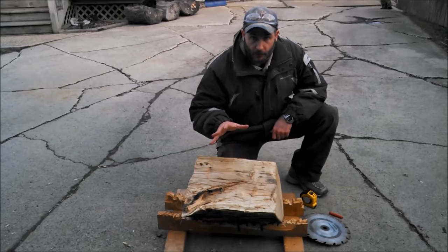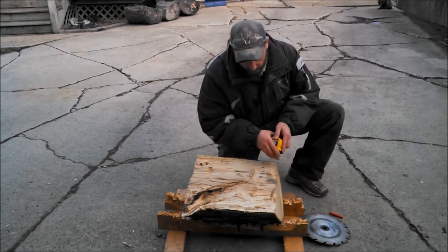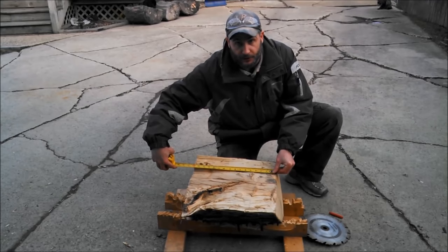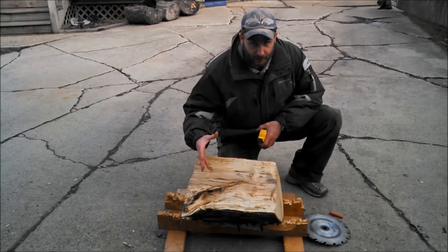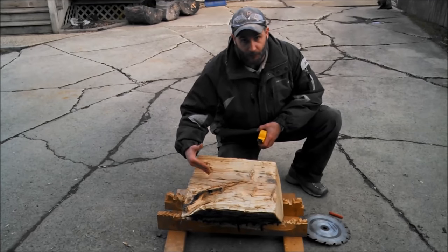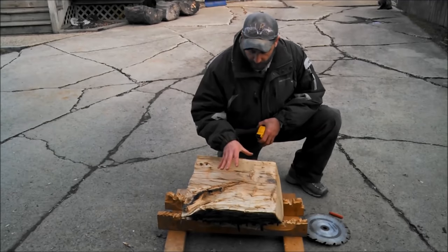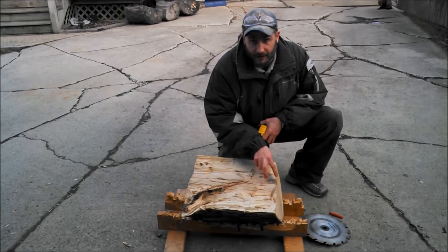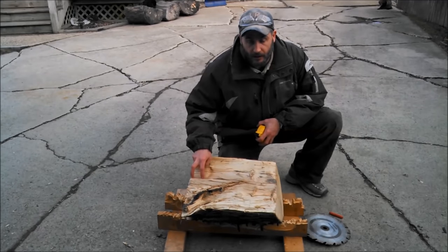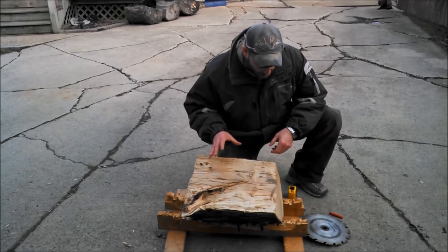Now, on the other hand, if you're dealing with wood that's been left behind by tree trimmers, you're going to be dealing with logs that are typically about 16 inches long, and that's because the tree trimmers will use their chainsaw blade and measure off the length of wood and then cut off the log. Now, with a log of this size, you'll typically have checking that's going to penetrate about an inch or so on each end.